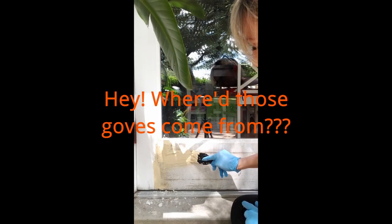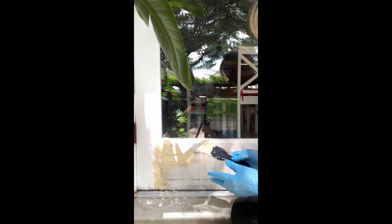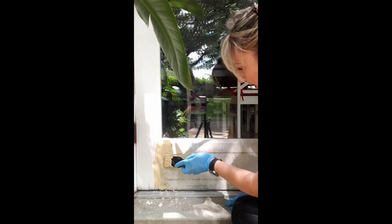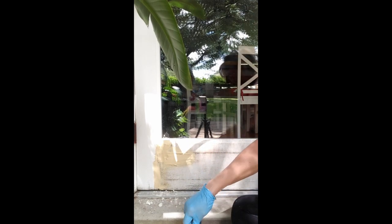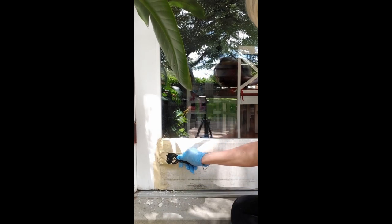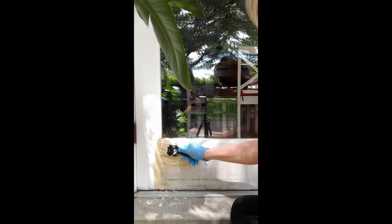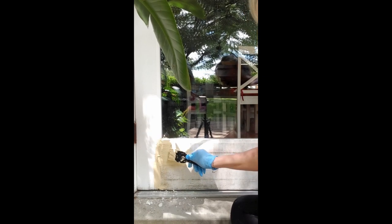Yeah, I'm definitely gonna put a second coat in here, a layer, because it's requiring a lot. I forget what they call it. There's a term I learned. Let me think. Proud. That's a term I learned watching my YouTube videos. They say when you make it proud, that means you're gonna have a higher level. It's gonna stand up higher than the level of the surface that you're trying to fill.